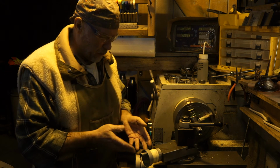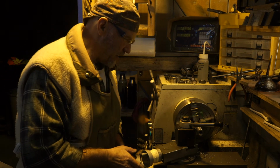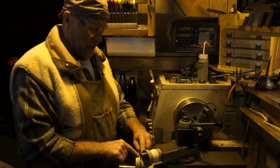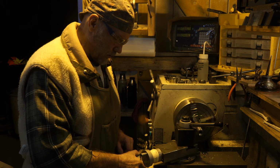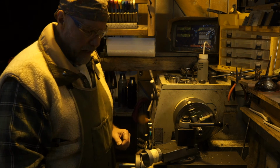This is where I have to be careful. I'm working on the wrong side of the dial and I'm talking. I have a serious risk of doing something seriously stupid. So now in my brain hole, I got to make 14 the new 0. And I'm going to go in. I'm going to go way in. I'm going to go in 5 thou.